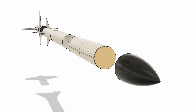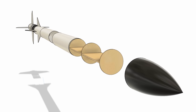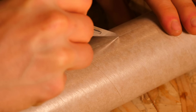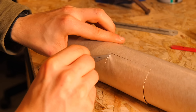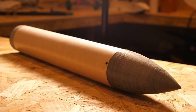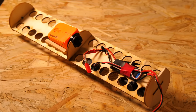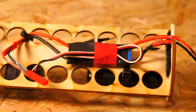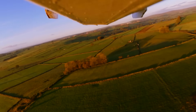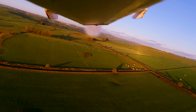An avionics payload bay is housed within the upper section of the rocket, containing equipment I'll be testing for future high-speed rocket aircraft. I cut a window for the onboard camera positioned facing down at a 10 degree angle. Second stage ignition is done through radio control with an onboard model aircraft receiver. I considered using a flight computer that would sense the deceleration following stage 1 burnout, but I wanted to test a similar RC system to what I'll use to ignite rocket plane engines mid-air.